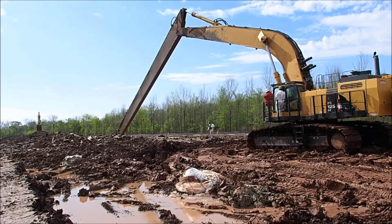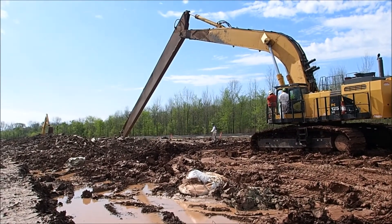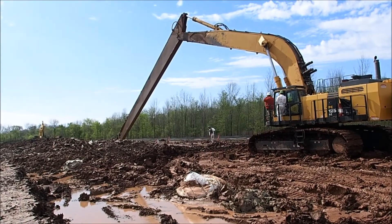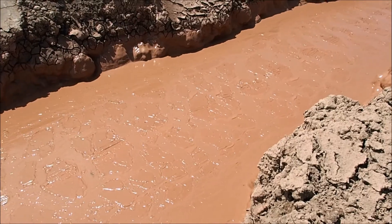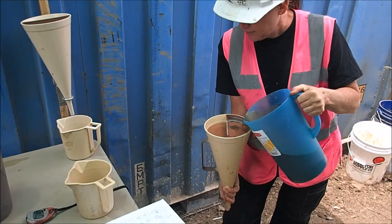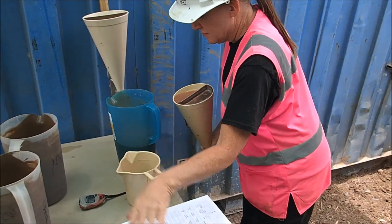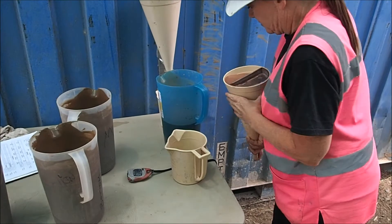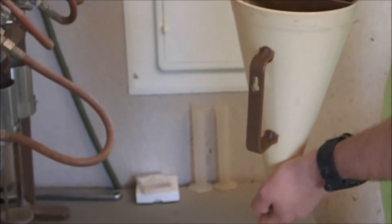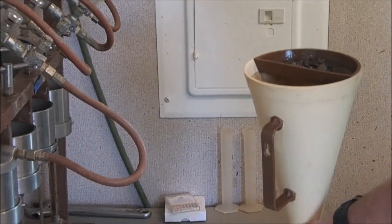In the back of the trench, we're constantly monitoring our progress. Here, we're tagging the bottom of the trench, but we're also, at the same time, taking a number of samples for analysis of physical parameters. Viscosity, for example, typically by marsh funnel. With this test, we're going to filter out the oversized material and time how long it takes a known quantity to go through a very well-characterized orifice. That gives us the viscosity in seconds — for example, 45 seconds by marsh funnel.